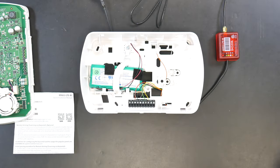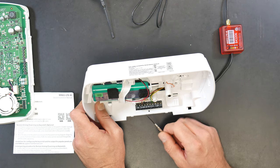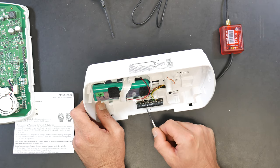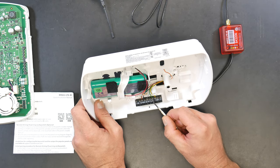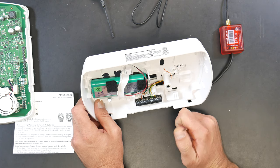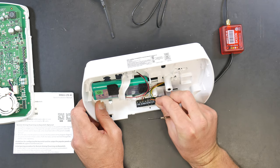For those of you that are going to be wiring this in for R-Control interactive, I'm going to show you how to get this done. That 5.6K resistor we talked about earlier — you're going to be wiring one end of that resistor into the AUX minus portion, which is already going to have that black wire in it. Get that resistor put in there with the black wire and get it screwed down. Then the other end of the resistor is going to be run into IO1, and there's also going to be another wire going into IO1 along with a wire going into IO2.